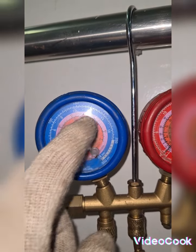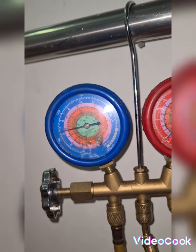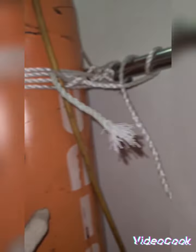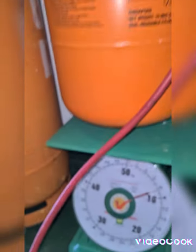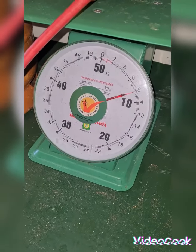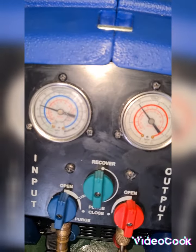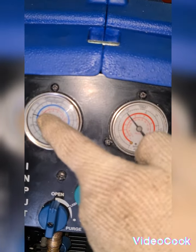Before 10.2 bar, now we have 4.4 bar — meaning the pressure is dropping, meaning the tank is getting empty. I'm able to transfer the refrigerant to my small tank. The pressure weight is now equal to about 2kg here, and the pressure here is steady at around 3.4 to 5.4 bar.